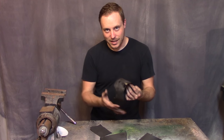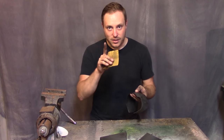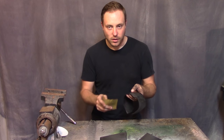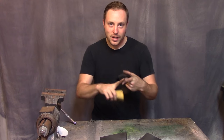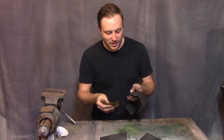I need to sand this to get it nice and smooth anyway. But if you're going to paint something, you need to do that. And that's also why it's important that everything is extremely clean — because if you have any grease or oil, it fills the cracks, so you won't have mechanical bonding and it creates a barrier that prevents chemical bonding too. Make sure your stuff is clean.